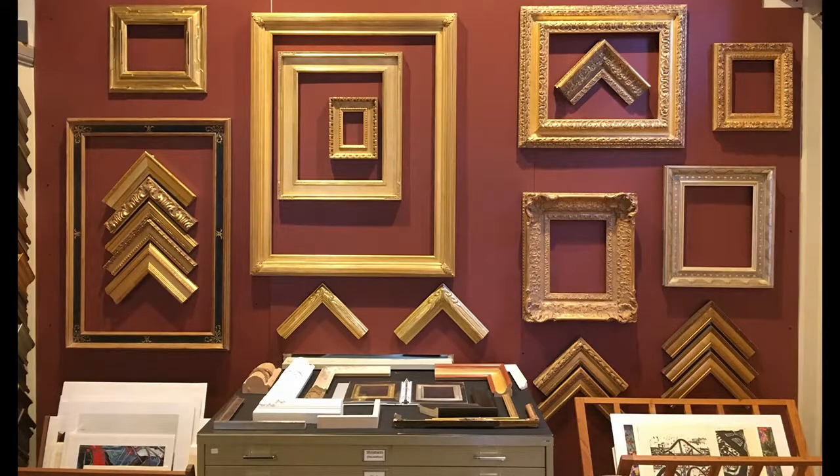I just wanted to show you a couple of projects that we had completed in our shop recently. If you come into our shop, this is the wall that you would see demonstrating our portfolio of work. All of the frames on this wall are water gilded with real gold, and it shows a number of different techniques — including hand carving, a technique called scraffito, which is basically scratching shapes into the gold, and another method called granito, which is punching wood and creating designs with a punch and a scratching tool. It also shows compo ornaments, which I'm going to demonstrate here.